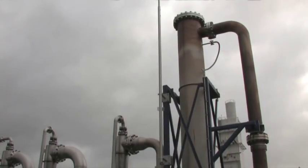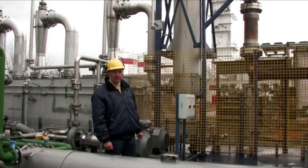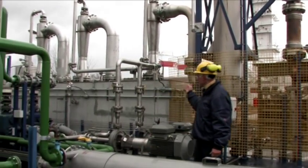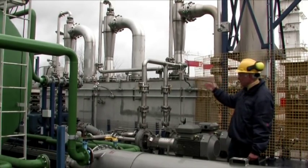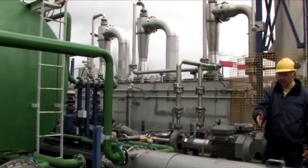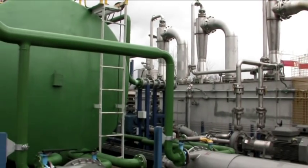From the air preheater, the gas goes into the column, where it is cooled with water, and is subsequently cleaned in a three-stage gas scrubber. The scrubbing water is pumped via pumps into this tank, cooled via heat exchangers, and returned to the Venturi scrubber.